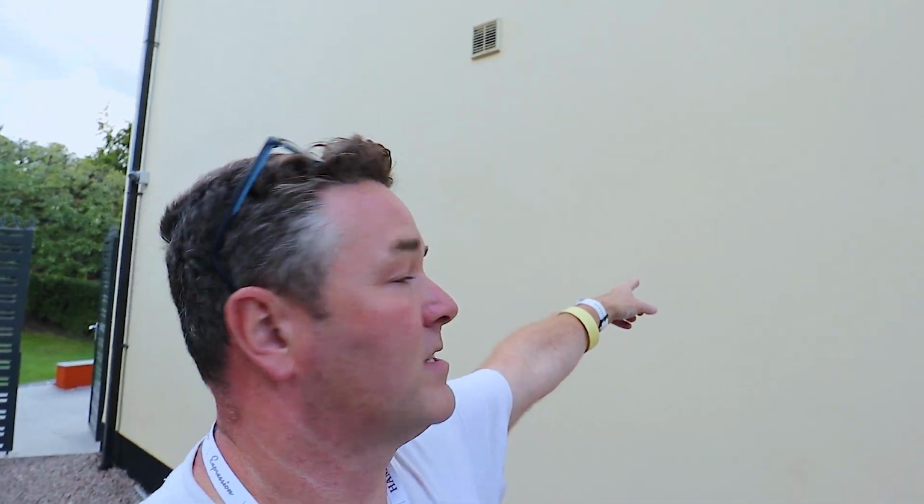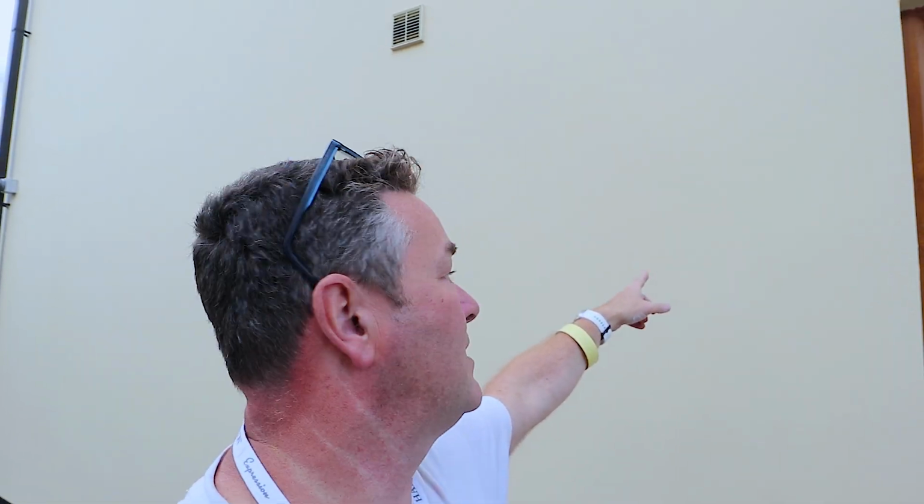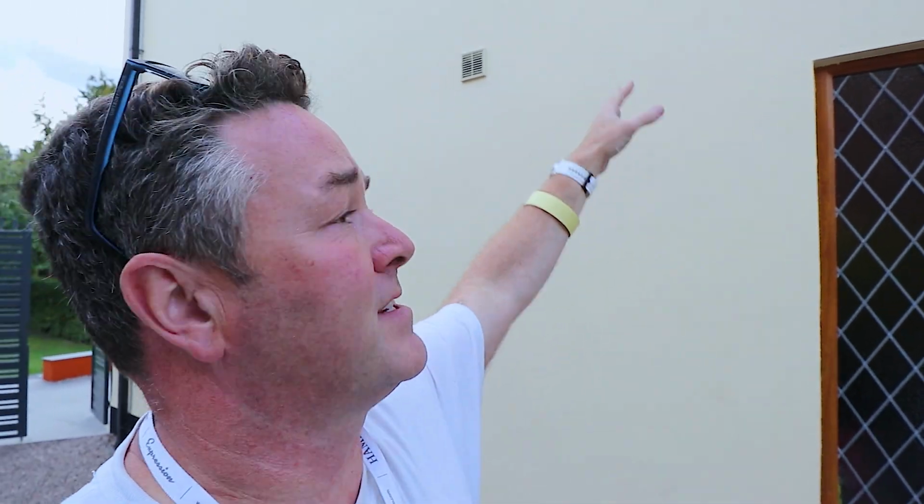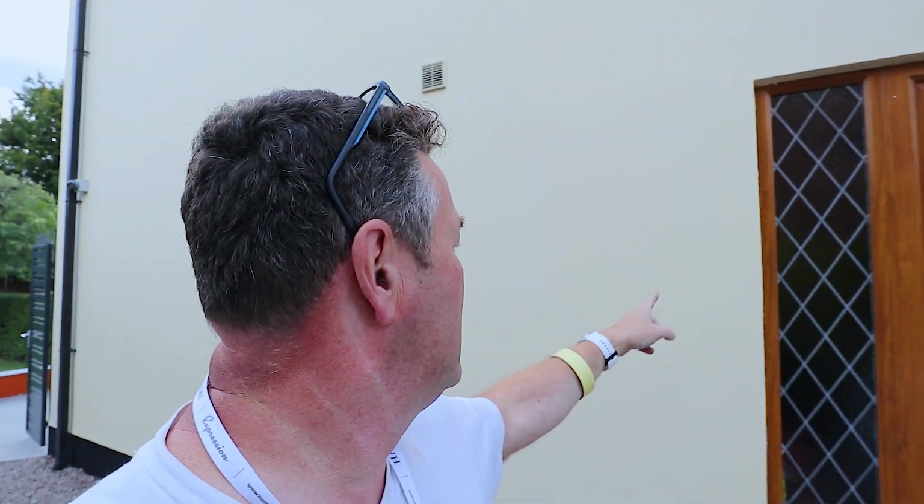So the other side of the house that had got the crack, because I've just gone from that side to this side, you can probably see it or probably not, we've got a crack there that goes from virtually top to bottom. I use the Andura paint, and I still use the same process of what I was just describing about raking out, peel stop and that Prestonet filler, and that's been done about a month. I'm not seeing any crack forming yet, so let's keep our fingers crossed on that.